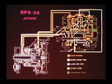Pressurized oil is also directed from the selector spool into the C4 pilot circuit, which is routed through the reverse lockout spool lands. The C4 pilot is actuated, permitting pressurized oil from the supply gallery to pass through the pilot and into the C4 clutch. The steering return, reverse lockout, and clutch lubrication circuits again remain the same.